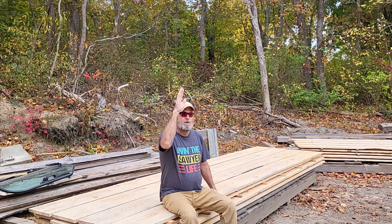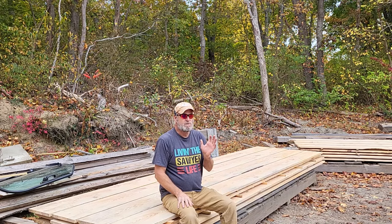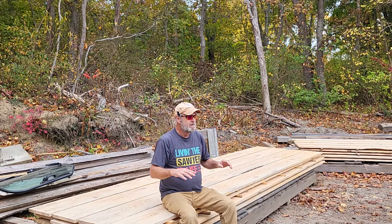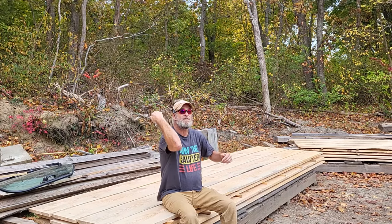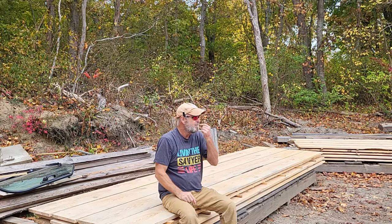He wants to run a full plank vertical in the eaves, so he asked me to cut them like 12, 13, 14 inches wide, 10 feet long, so he can put four pieces in basically and cover the eaves so you have a nice seamless look up the eaves. There won't be any boards going sideways.